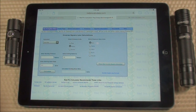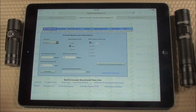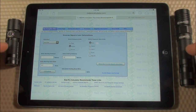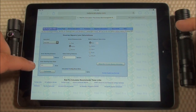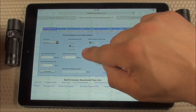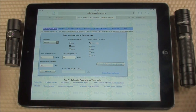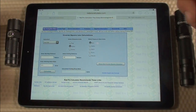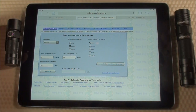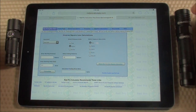Special shout out to Hurley Smith for that detailed explanation of inverse square law. Based off his recommendation, I went online and found an inverse square law calculator and put in all of the lux readings captured at one meter's distance for all the modes on both flashlights. I set the starting distance to one meter, entered the lux value for each mode, and then adjusted the ending distance until I got to that civil twilight lux reading of between 3.2 and 3.4. I modified results to fairly even numbers — like 8 meters, 9 meters, 8.5 meters — and calculated until I reached the civil twilight range.